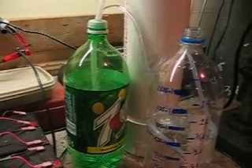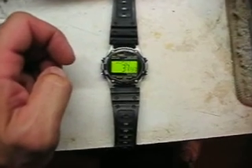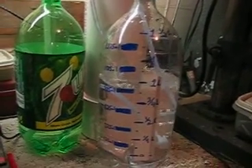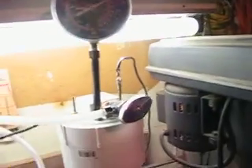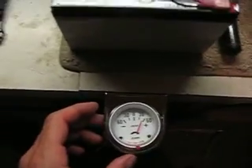We're getting quite a good flow — you can see all that action. We're at 34 seconds. We're going to stop at around 50 seconds and see what we come up with. We're right around 60 amps. The batteries were at 13 volts for both tests, so we're still at 13. I'm getting a little smoking on that lead, so we need to stop soon. We're right at 56 seconds, so we'll stop it right now — we have just passed a liter. We'll call that one liter since I went five seconds over.